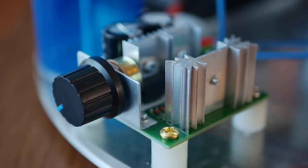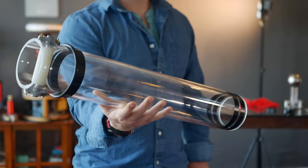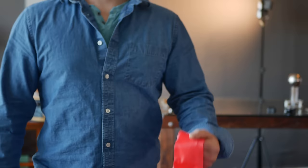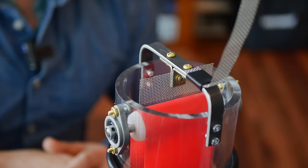Also in the base is a rechargeable lithium battery and a motor speed controller. Supporting the belt and top electrode is a beefy 4-inch acrylic tube — I had no idea at the time, but acrylic tubes of this size are not cheap. The top of the tube houses another ball bearing and pulley assembly; however, this pulley is made of Teflon and just kind of spins freely on its own. The belt is made of neoprene workout band, cut to 3 inches wide by about 2 feet long.